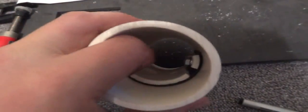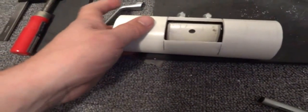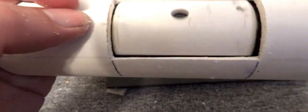I've drilled the second hole and bolted it down. This is what it looks like on the inside — one of the valves is closed, a really snug fit on the inside on both sides. I'm really happy with the way that turned out. I had to file away a little bit of the edge with a hand file so it's more tapered going in, to make sure the valve closes properly. Now it's nicely opening and closing.